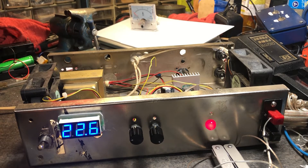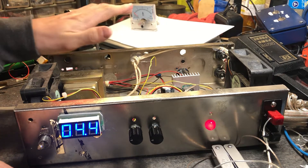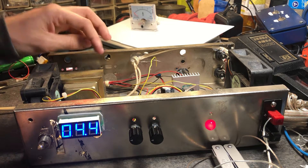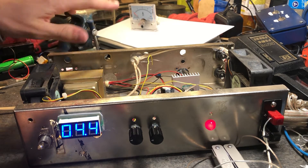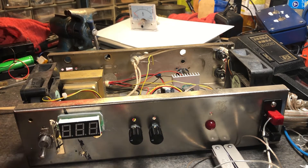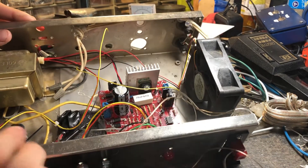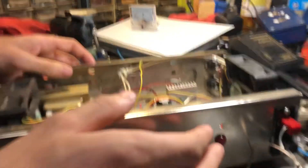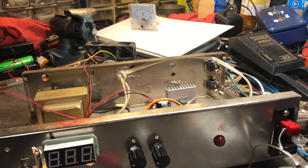What I am going to do is put in a fuse — I haven't done it yet because I didn't know about all the features. It has its fuse from the transformer power supply — a 10 amp 250 volt AC fuse. So basically if I draw too much from this, this fuse will blow instead of the board, which is nice. So we've got two fans, the transformer, and there's the fuse — it's one of those screw-in ones so you can screw it and unscrew it when needed.